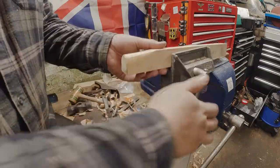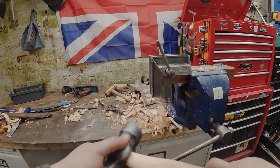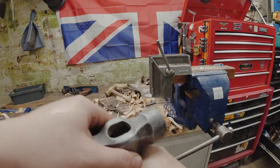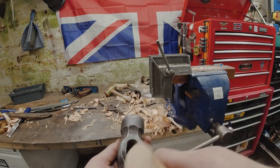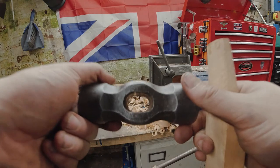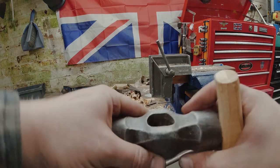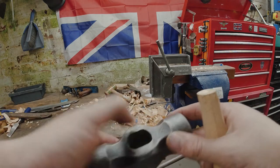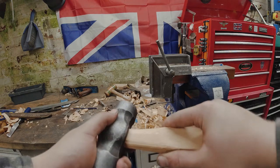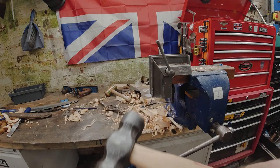Okay, so we've marked out the top piece here and just going to do a little bit of a test fit — we're starting to get there now. Once you've got your outer profile, a lot of the times you'll have to note that hammer eyes are actually one hole bigger than the other. Depends — some of them are, some of them aren't. I think axes especially are more tapered, but that's the top of it — X marks the spot I'm assuming. Just got to keep going down now, marking it up and giving it a little wiggle, and then you'll have bruising that comes across on the top here which indicates where you need to take off. But we're getting there.